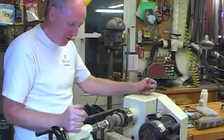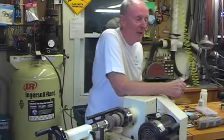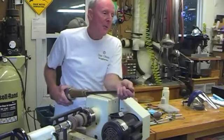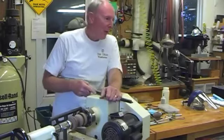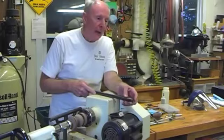All right. Anybody have any comments or questions? Thoughts? Those bits you're using over there, high-speed steel bits? On these bits? Yeah. You know, what I use is the quarter-inch high-speed steel. Okay. And they're the 2-inch. And they're used in metalworking, so they're meant to remove metal. So they should remove wood pretty well, too, right? Mm-hmm. And once they get dull, these are easy to sharpen, because you basically...